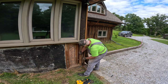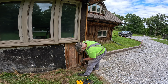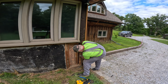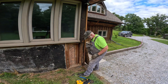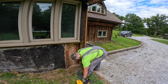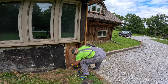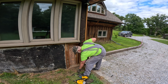Yes, the little mystery wall has been open, and thank goodness there is a cement foundation at the bottom of this. For some strange reason, they dropped it down before the corner, and then it went around the corner, so that's fine. But it was still pretty flimsy, so what I've decided to do was frame it out a little farther with some 2x4s, and then add a couple of pressure-treated 2x4s to the bottom, and then some 2x6s on top of that. Now that's going to make for a good, sturdy piece of wall.